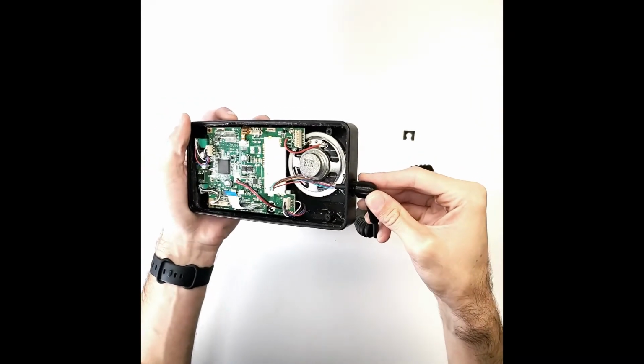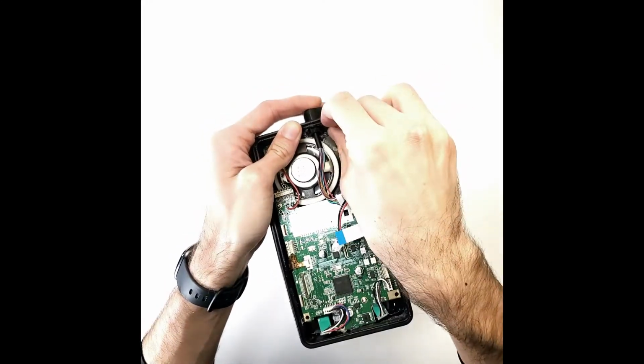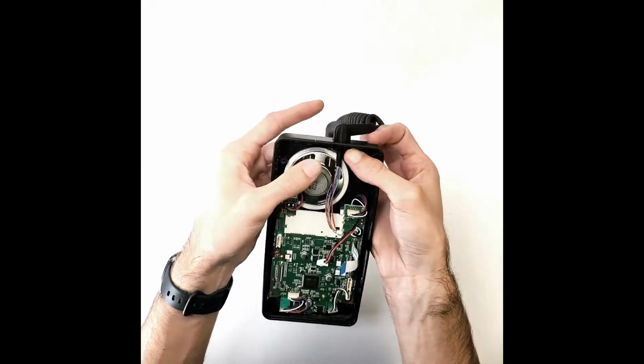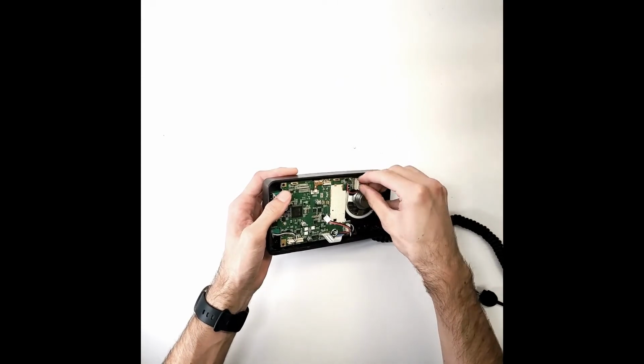Note the orientation of the notch on the cable, since this is where the Max Marine Electronics cable will stay. Press the strain relief of the new cable into the hole and slip the lock ring into place. Once the relief is all the way in, ensure it's a firm fit. Connect the Max Marine Electronics cable to the printed circuit board.